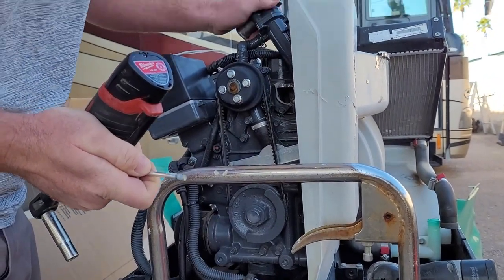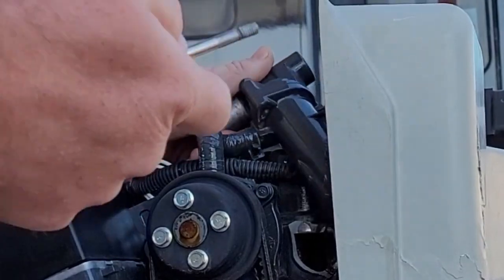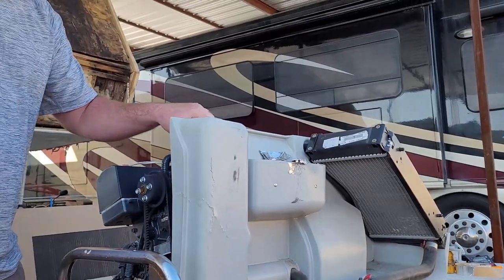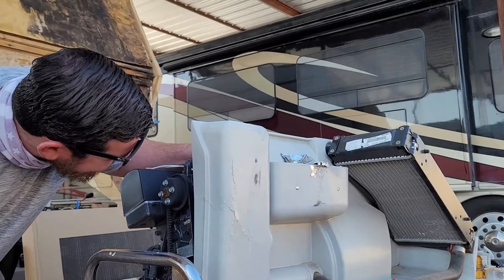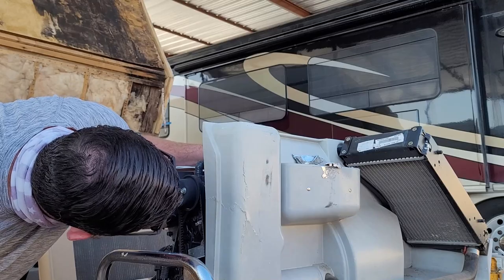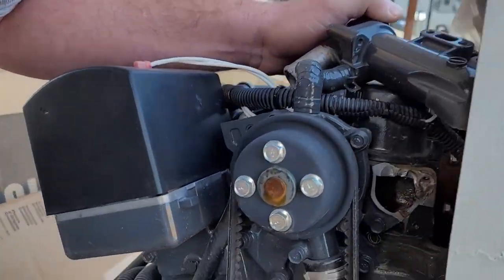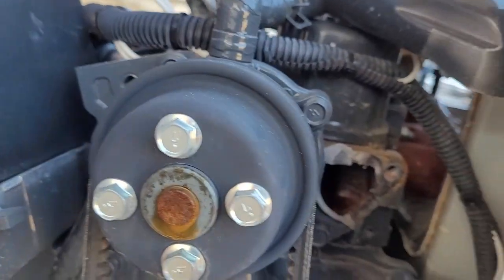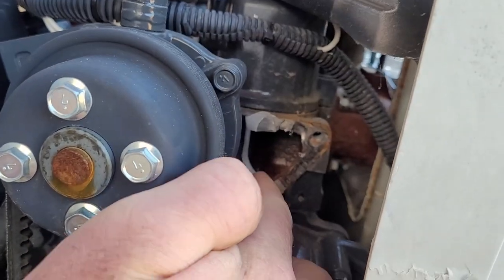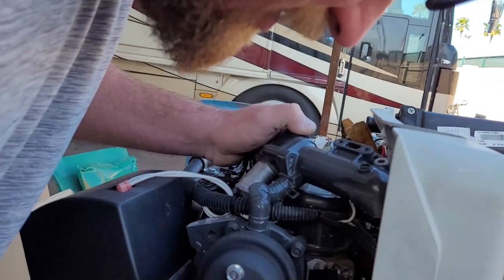You trying to do that thermostat housing? I wanted to be the person to open this and say, James, block isn't cracked. The block is not broke. It appears to be okay. So this is just gasket material. That is the water housing. Right, we ordered that. So we just need to replace that.